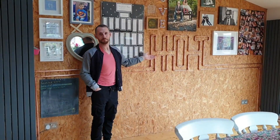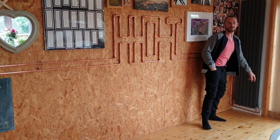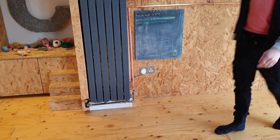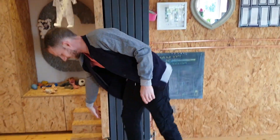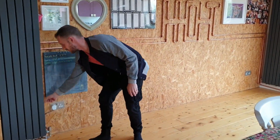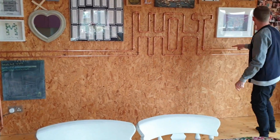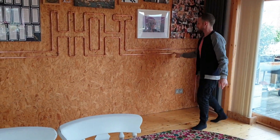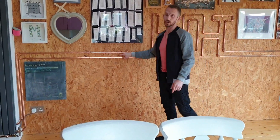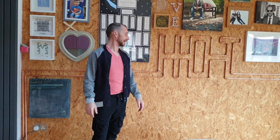So this is it — this is the finished product. The pipes go all the way across as I told you, back down. One goes into the flow and one goes into the return, both sides. The water supply comes from up the top here, comes down behind this boxing in, connects to this radiator. I've teed off this radiator at the flow and return to give me my two pipes — one would be the flow, which goes all the way around, goes into the radiator, comes back down, and then this one is the return. It's important that you still have your flow and return if you've got a two-pipe system. Each corner here is about two quid, and it took about 20 metres of copper piping, a little copper cutter, and just help from a plumber friend to help me connect up to the radiator.